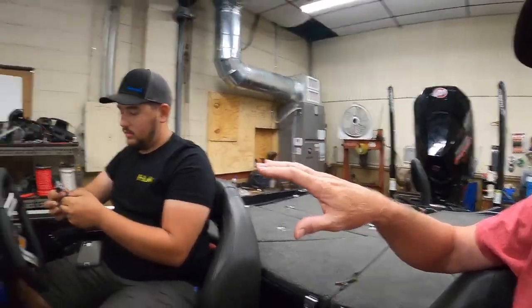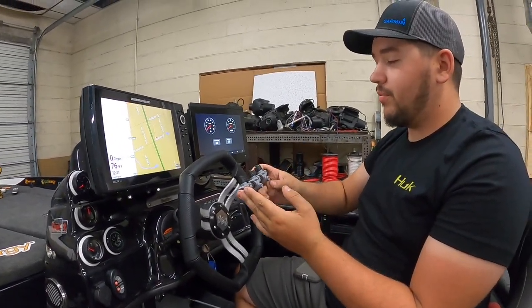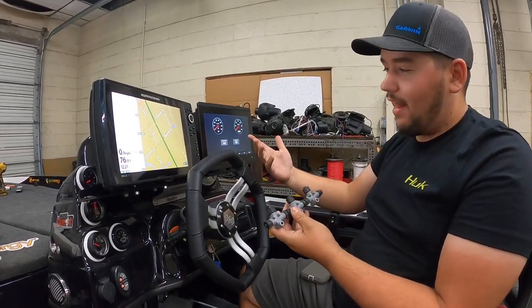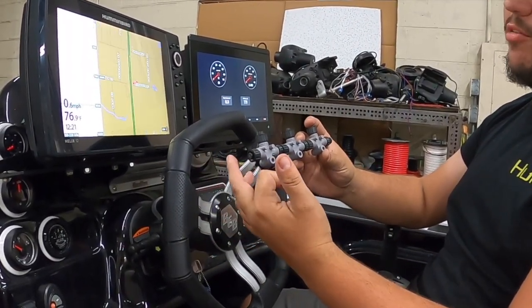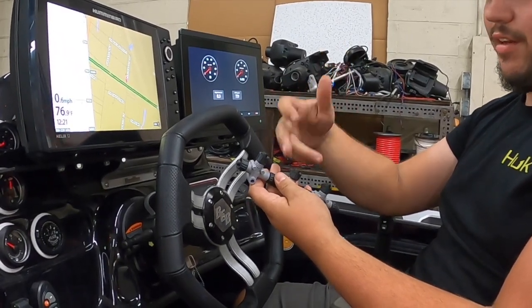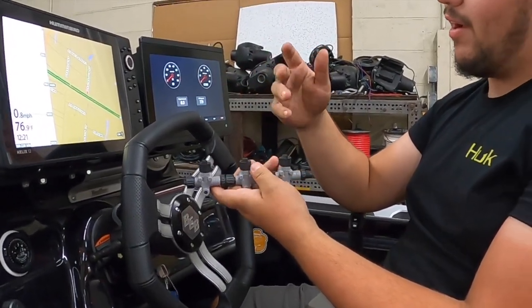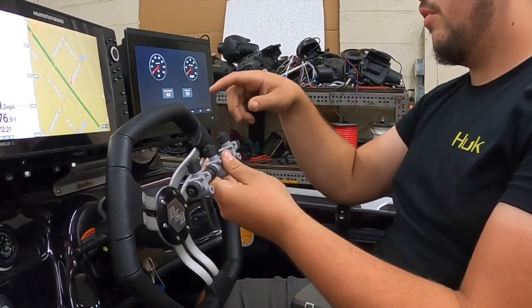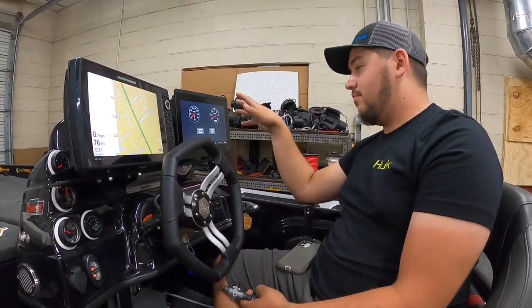You saw how that got wired back under the cowling. Now we'll show what we've done at the front and where you go through the selections to get the readouts. As a quick overview for people who don't know NMEA 2000: in a NMEA kit you'll have terminating resistors that end the network on each end. Then you have T-connectors where information comes in and out. In Ken's setup, one T is his graph, one is power — you have to have 12-volt power — and one is data coming from the engine. It's making a loop with power and data flowing through.